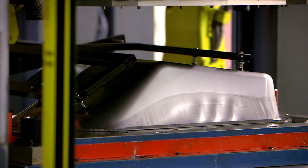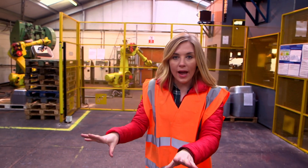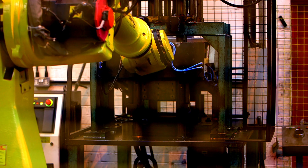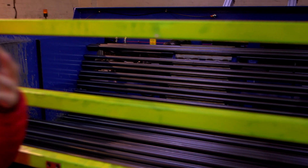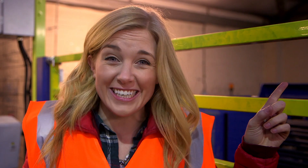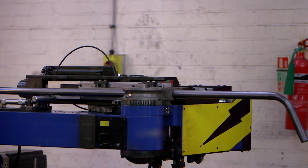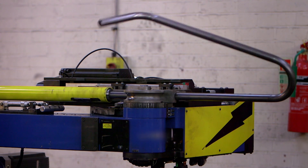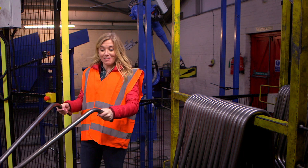I love all these yellow robots — watching the way they flick up the metal pan and swing it to the next machine. They know exactly when to pick it up and where to put it. The pan is put in this machine which makes four holes in it. These holes will be used to attach the wheels and handlebars later on. In here are lots of long poles — they're made of steel too and they're going to become the wheelbarrow's handles. But how does something long and straight become two handles? Well, that's thanks to some more robots, and they're very noisy. The first robot bends the ends of the pole to make a small curved shape, then it bends the whole thing in the middle to make a larger curve. And you end up with something like this — it's a funny shape, isn't it? But if you hold it in this position you can see it's a pair of handlebars.